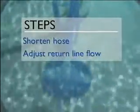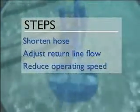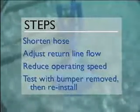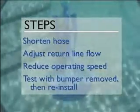In the event that Creepy Crawly becomes stuck at a pool obstacle such as steps, pool lights, or ladders, call the Creepy Crawly customer helpline, or use these tips to help the cleaner move out of the area. If steps are a problem and the vacuum connection is at the other end of the pool, shorten the hose enough so that the cleaner just misses the step. If necessary, use the return line flow to push the hose away from the steps, or use the instructions in your owner's manual to slow down Creepy Crawly. You may also test Creepy Crawly without its bumper strap. If this seems to correct the problem, cut one inch off the bumper strap and reinstall it on the cleaner.